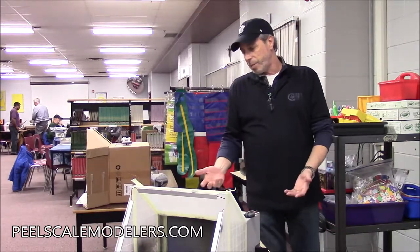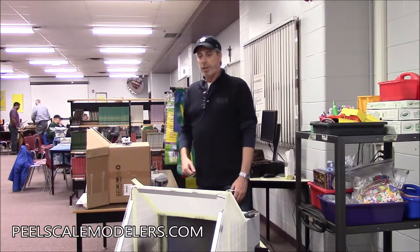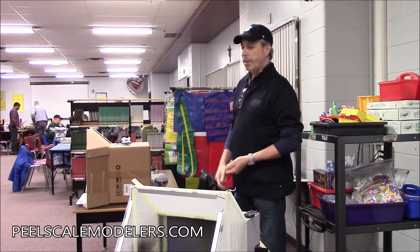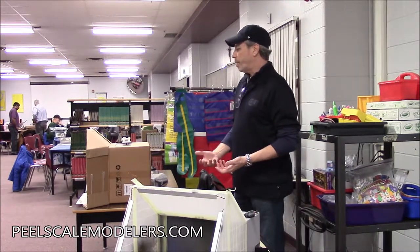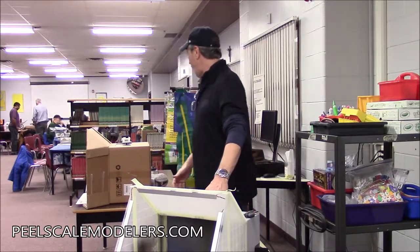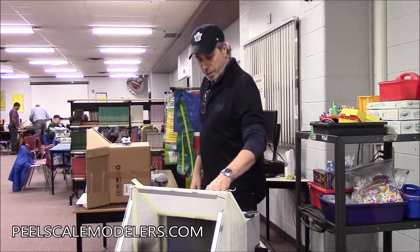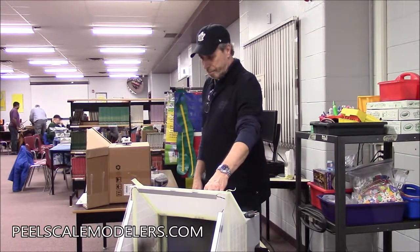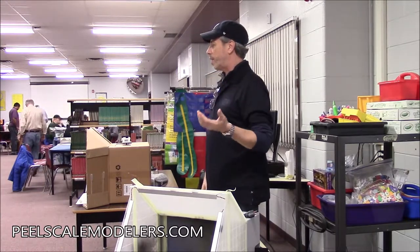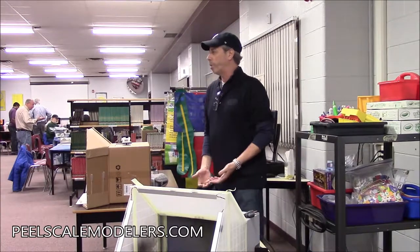And then there are other types available that are metal, and they're quite expensive, $300 and up. And there are different ways to draw air. Most of them draw from the back. John's here is set up to draw from the back. Mine draws from the back. I've seen a few people that have them draw from the top. That's actually not the best solution for particulate. The best is actually to draw from below.